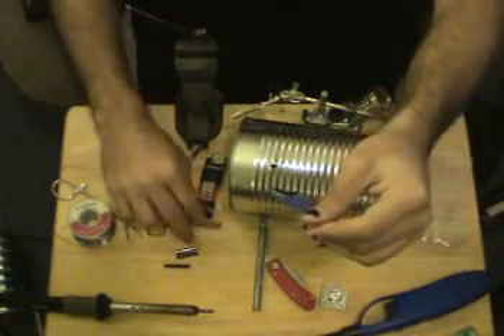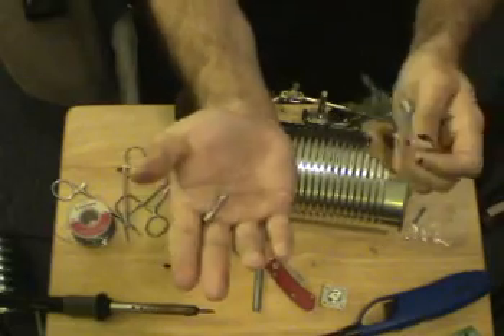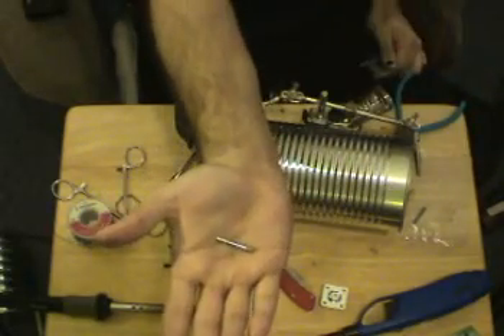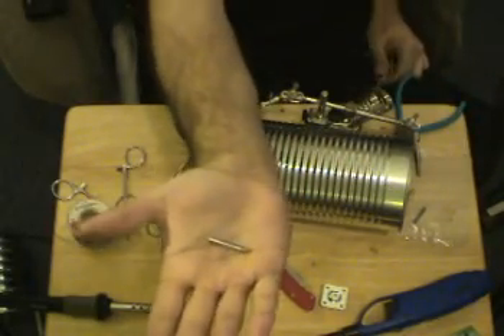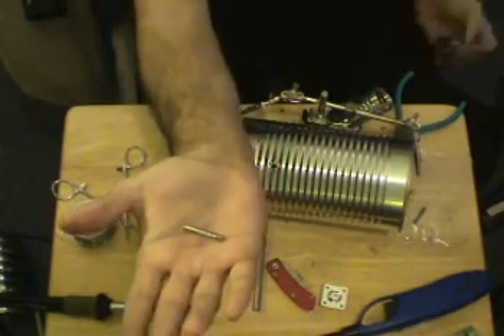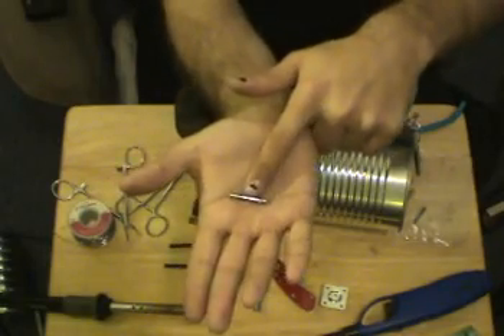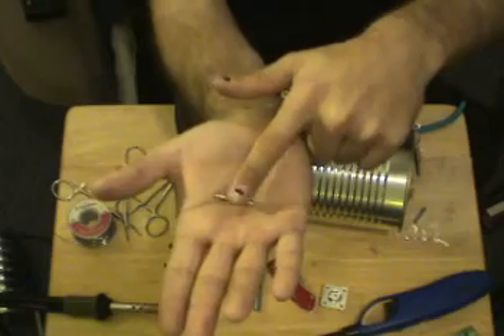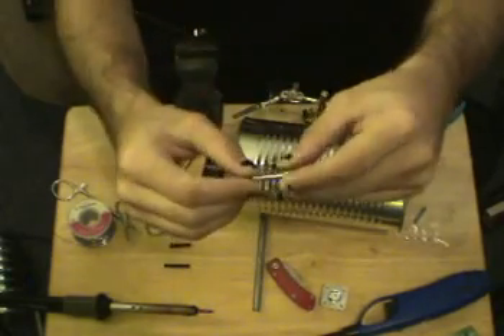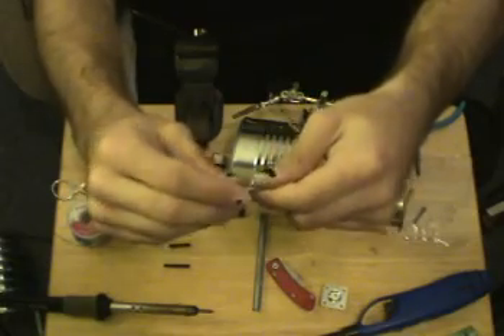I've got a thinner piece of pipe, obtained from an old antenna. If you have some old pens, the ink cartridges are also solderable metal. If they're shiny and chrome, chances are you can't solder to them — so use a nail file, sandpaper, or an abrasive wheel on a rotary tool to get a nice copper coat around the side of it.